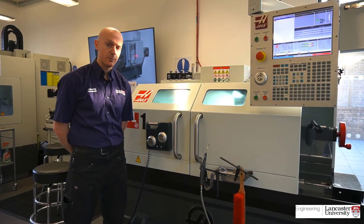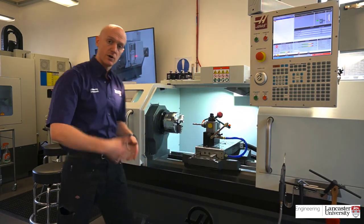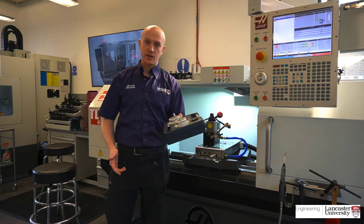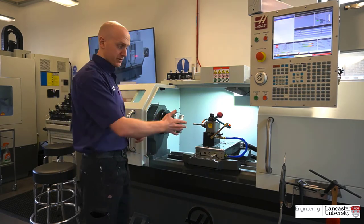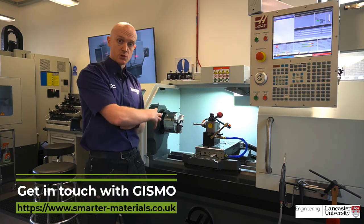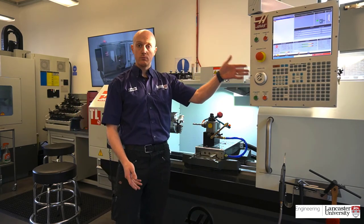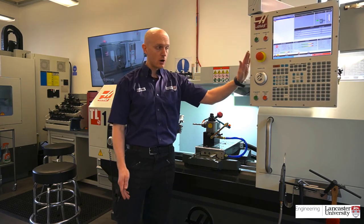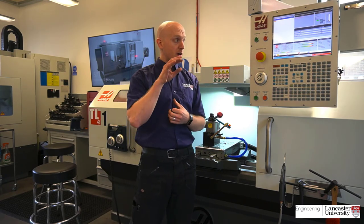This is our TL1 Haas lathe — we've had this for about 6 months now. Whilst it is a CNC lathe, it is also a manual machine — it's almost like a hybrid. It has a manual controller, just like you would find on an old-fashioned conventional lathe, with your Z axis and X axis. The reason why we opted for this machine is because we do a lot of one-offs and bespoke components. Utilising the manual side of it, we can get stuck into the machine and see exactly what we want to machine, just like on an old conventional machine. But besides that, it still has Haas's Version 2 Advanced Manufacturing Controller, which utilises a VPS — visual programming system — enabling the operator to program really complex parts reasonably quickly without having to use a CAD-CAM package.